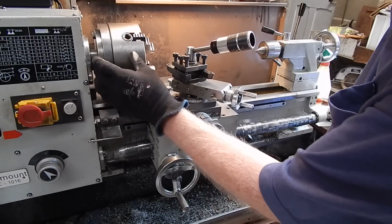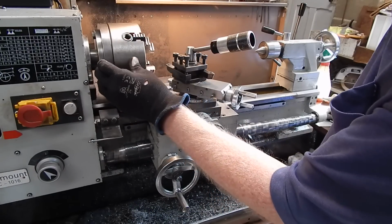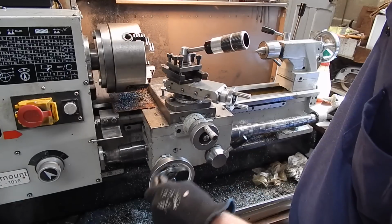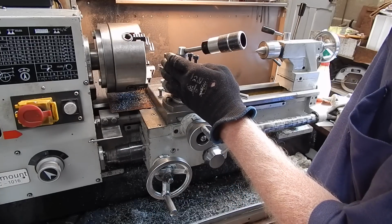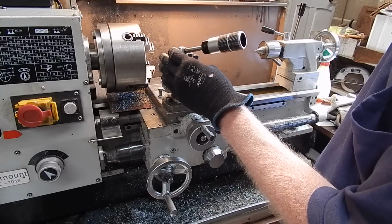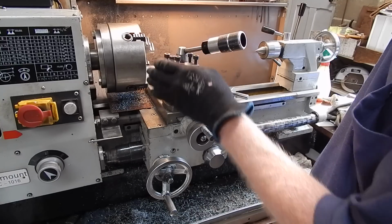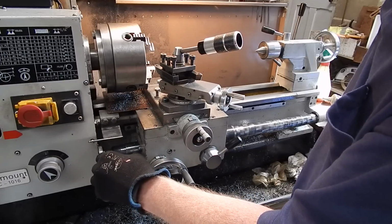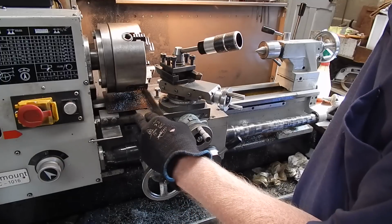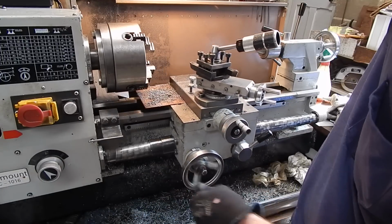In fact, if you've got a small chuck, like a 5-inch, this is a 6-inch, with my 5-inch I can get up to it okay, but I've got to watch it, because if you don't have the cutter set at the right length, your clearances can get minimal, where you can easily run up against the fully compressed cover, and bang, carriage gets obstructed, away goes the shear pin on the lead screw, and that's no big deal.